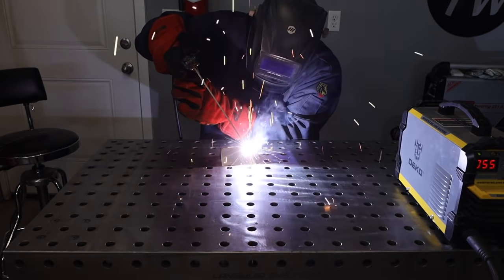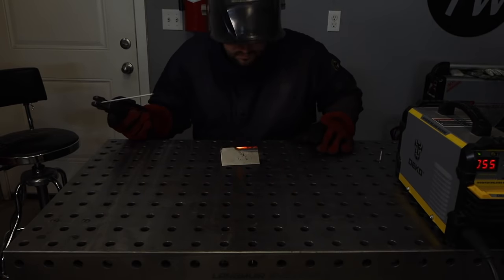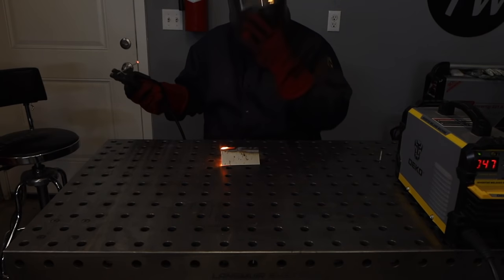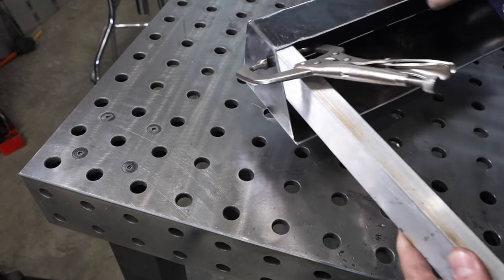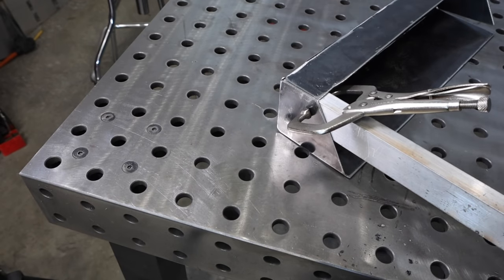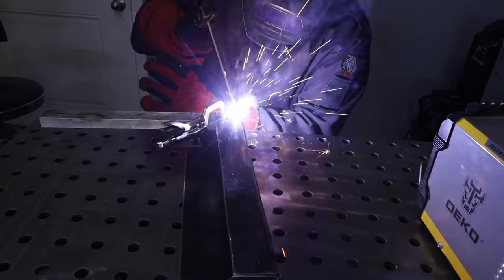Running this test weld, I started at 55 amps, I can see it's running a little hot, so I bump it down about 8 amps and that's working out pretty well — I think I'm ready to go. I'm going to show you another trick as insurance because it's pretty easy to burn through when stick welding on sheet metal. I'm going to take this aluminum bar — I use these as chill bars for TIG welding, especially with stainless steel — and clamp it in the corner. The aluminum conducts heat so quickly that if the arc or weld pool dips down into it, it won't melt the aluminum; it'll just conduct the heat away and help keep you from burning through.